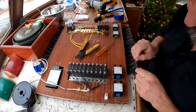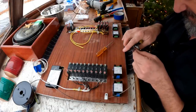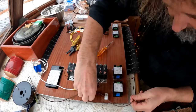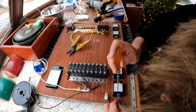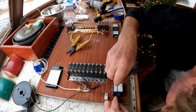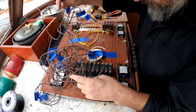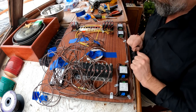I'll just have to label them as I work my way along. They'll all go down there in a bundle and back into the main panel. The connections at these little meters are simply little clamp screw terminals — fairly straightforward. Interestingly, the AC meters have one side for current, one side for voltage, but there's no polarity, so no reason to worry about which is which. I'll simply mark them as the voltage side or the current side.